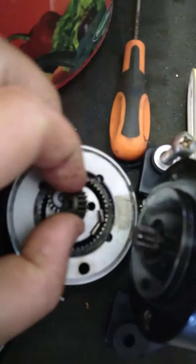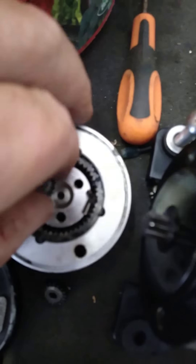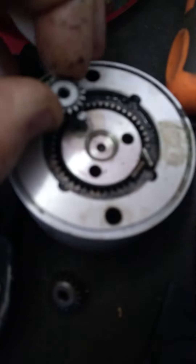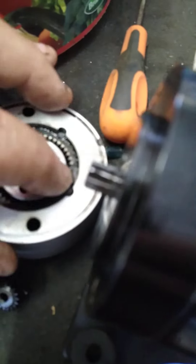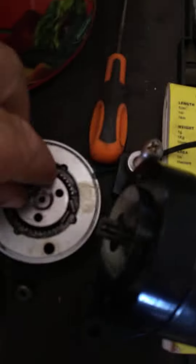What's happened, why she's locked up is for some reason all the gears have come adrift. These little gears — there should be three. And it's sheared off where these holes are. It should have pins like that. And it's sheared the pins off. So there's three gears sitting there, one there, another one there and one there. And then the centre goes between the gears and it drives it all around. So yeah, it's all locked up.